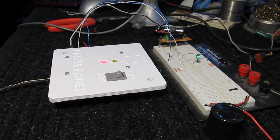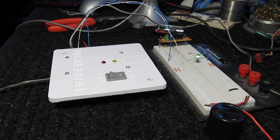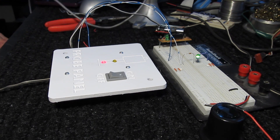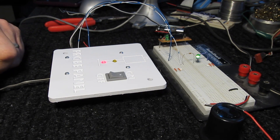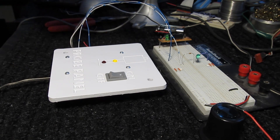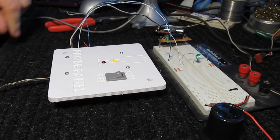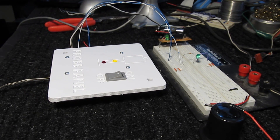Whether this has power off or power on with no probe, it'll now look like no contact. Otherwise, whether it had power on or power off, it'll always look like a detection. So basically what I'll do is when I'm ready to go, I'll have my drivers all turned on. When I'm going to use the probe, I can just plug it in and it's ready to go. But if I want to test the probe and I don't want to send signals to the computer, I can just disable it, so I can test the probe without getting false signals.